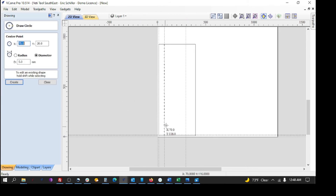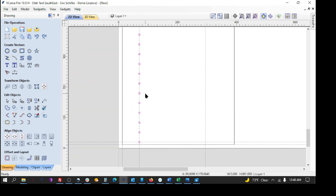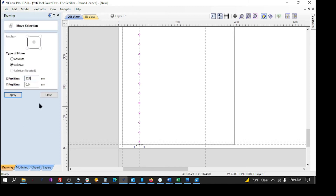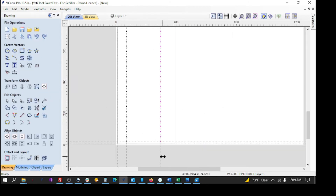There are different ways to do two rows with 224-millimeter spacing. I prefer to get one row right first, then work on it. I take this set of vectors — they're all grouped — do Control-C, Control-V. That copies it to the clipboard and drops another set of circular vectors right on top of the first one. Then I move them over in X by 224 millimeters, which puts them right on that guideline. That works better than a two-column spacing array for me.